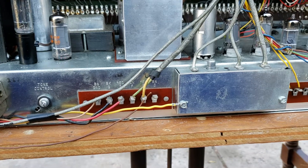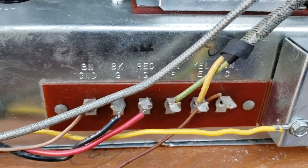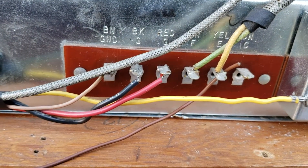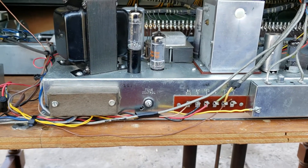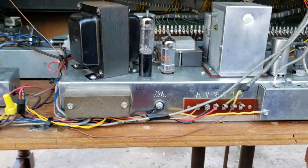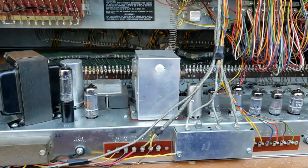What happened was that as I did some work on the undercarriage of the AO-28, I inadvertently loosened the wire here, the brown wire, coming from the vibrato line box. And it eventually broke off — so that broke away from the terminal. And therefore, it was totally disconnected from the vibrato line box, and therefore you're not going to get any vibrato.